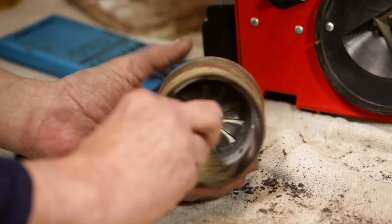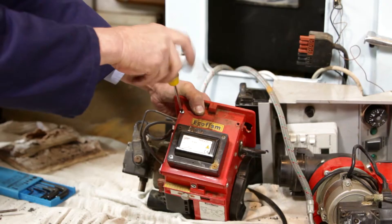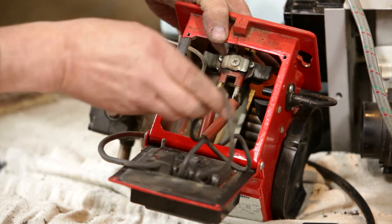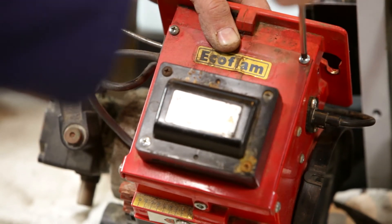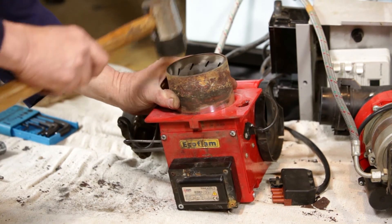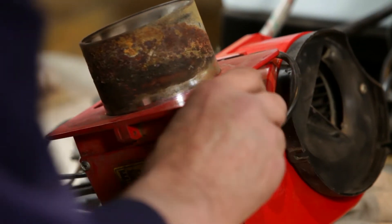Clean the fan casing and deflector plate and then reattach to the casing. Clean the blast tube and check for damage. If there is any damage present, the blast tube will need to be replaced. To inspect the electrode leads, remove the cover by removing the two screws. If there is no sign of wear or damage, re-secure the access plate. Re-fit or replace the blast tube, making sure that it is relocated correctly. This may need a gentle tap back into place. Secure back into place with the two allen screws.